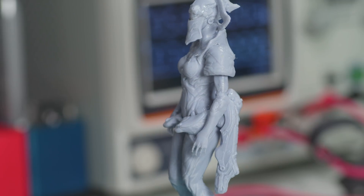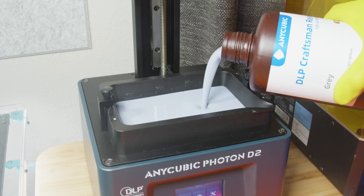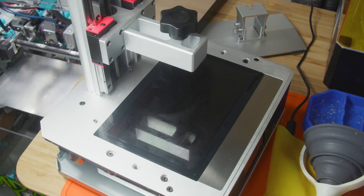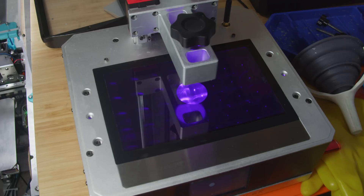There's another application that calls for powerful lights, crisp details, and perfect blackness: resin printing. Resin printers create very small models with incredible detail by shining a powerful ultraviolet light into a clear bottom vat of liquid resin. The photons energize catalysts called photoinitiators, causing them to link up nearby molecules and form a rock-hard polymer. Most hobbyist models use a technique called masked stereolithography — an MSLA printer literally displays a cross-section of the model on a clear LCD panel, shines a floodlight through it, raises the plate, and repeats, fabricating a detailed print one layer at a time.